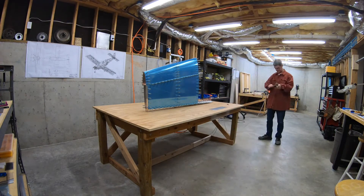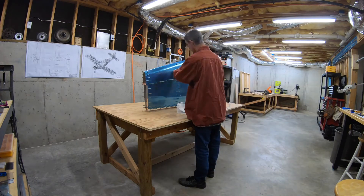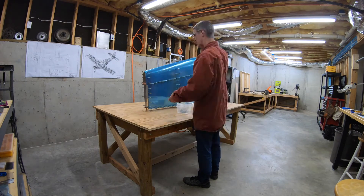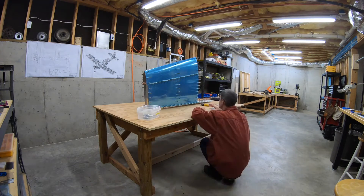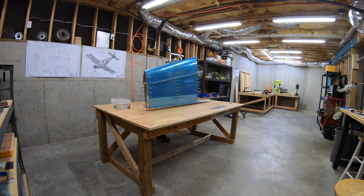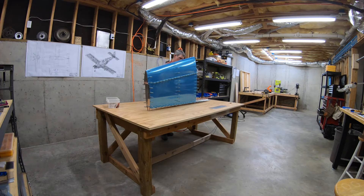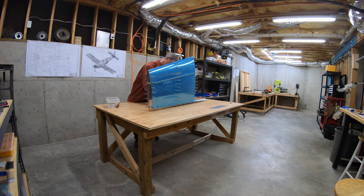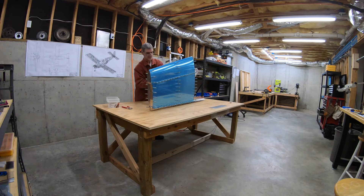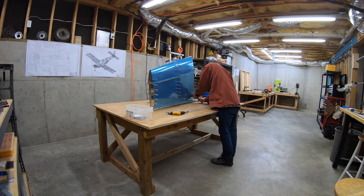The next night, the 28th, is step 4 — final drilling the skin to the skeleton with a number 40 drill. You drill every other hole, move the clecos, then drill the ones in between. I used a straight-fluted reamer instead of a conventional drill bit — it makes a nicer hole going through thin skin and rib. One thing I noticed is that the reflection of the fluorescent lights in the skin makes it look like there are dents, but it's actually perfectly smooth — just the angle catching those two fluorescent lights.